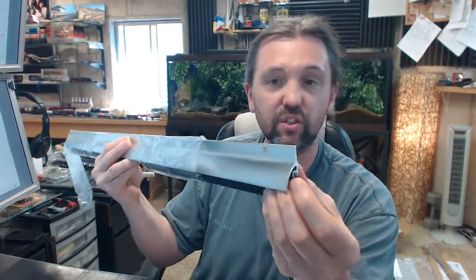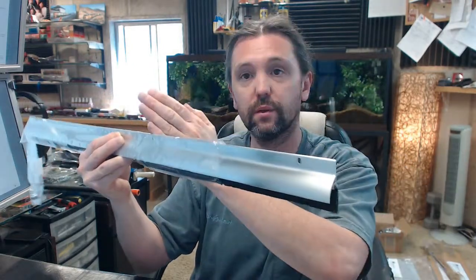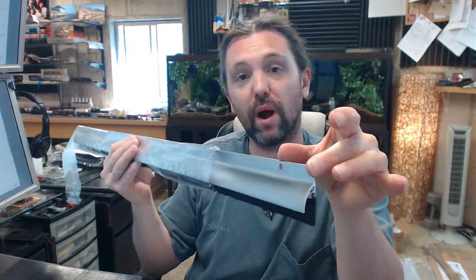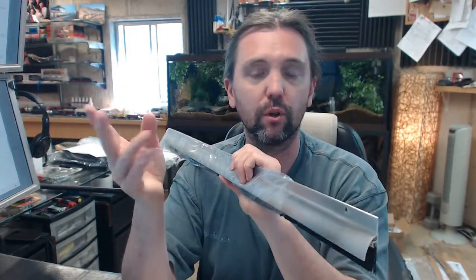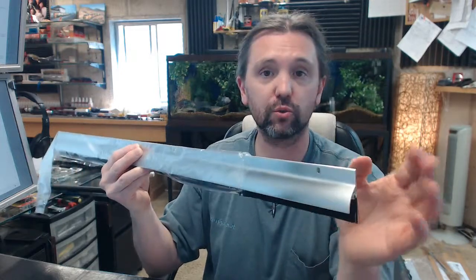The reasoning is if you had to take a 36-inch piece and cut it down to say 34 or 32 inches, you would eliminate that slotted hole, and the next one is all the way over here. Speaking of those slotted holes, screws are included in a complimentary finish. If you order a custom length, we will not only locate that hole at the proper distance from the edge of the first one, but at the proper center to center as well. It is nice to have a slotted hole from the factory, especially for a door sweep and for weather stripping in general. A slotted hole will help you tailor that sweep to the bottom of a sill that may not be level or a door that may not be plumb. It will also help compensate for a hole that has been misdrilled — when you are pre-drilling through wood, aluminum, steel, or fiberglass, the drill bit has a tendency to walk a little bit before it pierces through, especially if you have not used a center punch. So that slotted hole will also help compensate for a misdrilled hole as well.